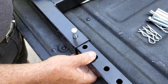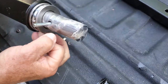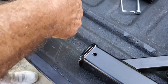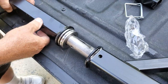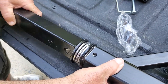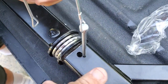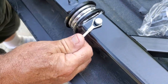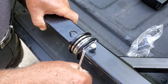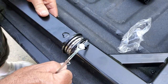All right. The next step will be this right here — this is the bearing section. That'll fit right here. We'll take this protective coating off and we'll grease this up before we put it in. What this does is it allows the crane to swivel around to where you need it. There'll be a pin that goes in here — this pin right here will fit right here and then it'll lock on the other side. That will keep it locked in whichever position you want. You may want to turn it a little bit more and just swivel it around, but if you need it locked you can always lock it right here.